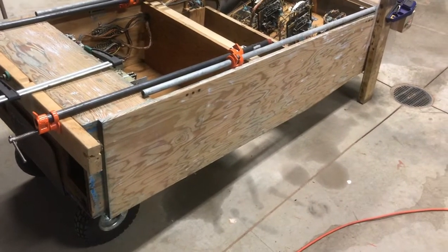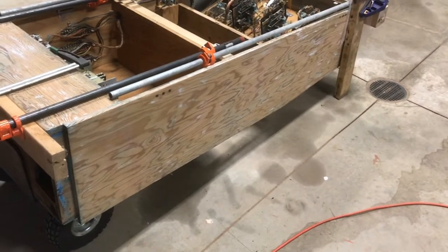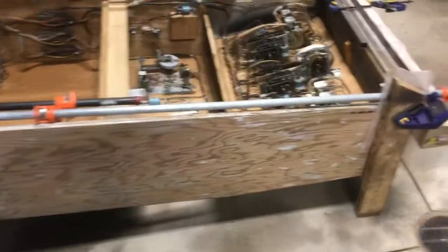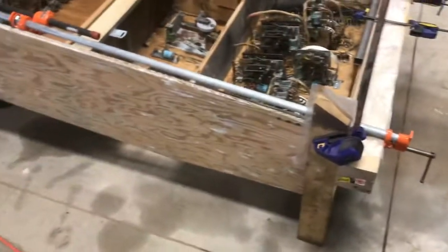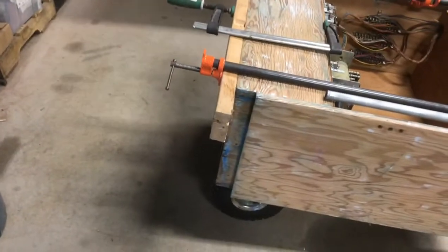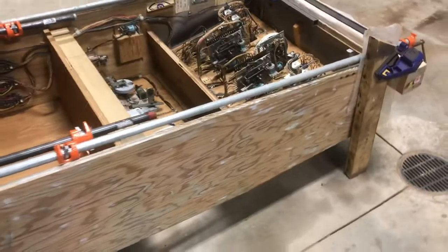make sure all the citrus strip and the mineral spirits and everything else was gone from the cabinet, because that made the sandpaper gum up a lot less. I didn't focus on getting it down 100% to wood. You see those little spots of primer. I didn't want any blue, really. I wanted to mostly get the primer. I wasn't super concerned about this area where the foot goes, but the front, I guarantee, is sanded.